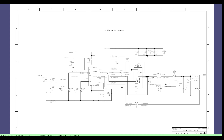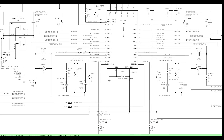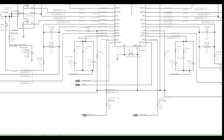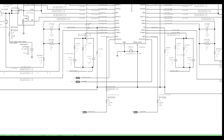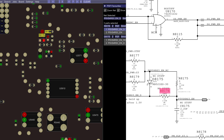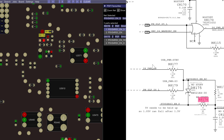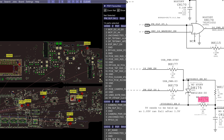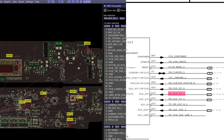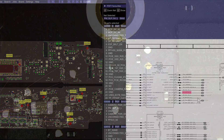If we scroll over here, I need this enable signal for my S4 rails to come on — P5VS4RS3EN. This is coming from P5VS4RS3EN, and if you follow that back on the board view, you'll see that that goes over to here, which then goes over to PM sleep S4L. PM sleep S4L comes from the PCH right here. So that's what's wrong.